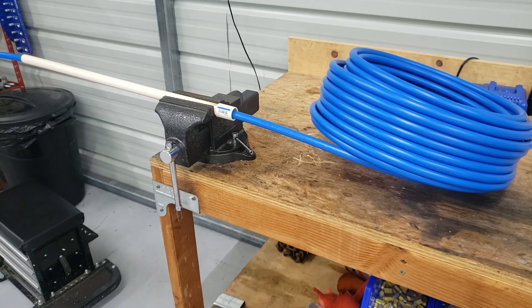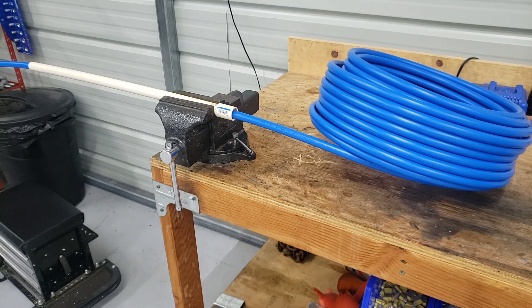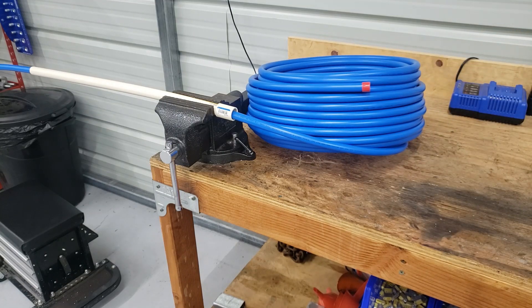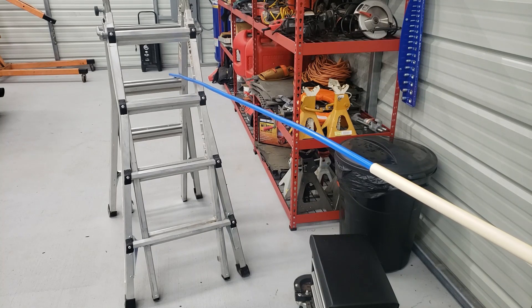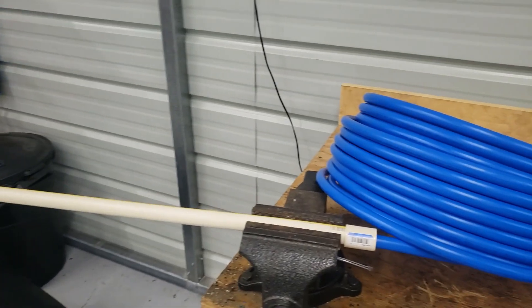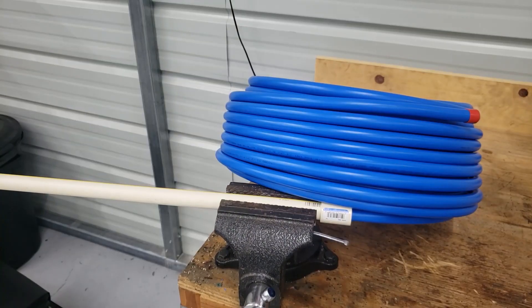It's up to you. You may have to bend it just a tad to get a slight curve out of it. But as you can see, I'm feeding it in and it's taking it and straightening out. Here it is from a different view — it's working pretty good. For my purposes, it does not have to be perfectly straight. Now, if you want it perfectly straight, you're probably going to have to invest in a $120 to $150 straightener — a multi-pulley straightener that you feed it through. I didn't see it as necessary to spend that kind of money just to get air lines straight. And here it is from the coil — it's as simple as that.